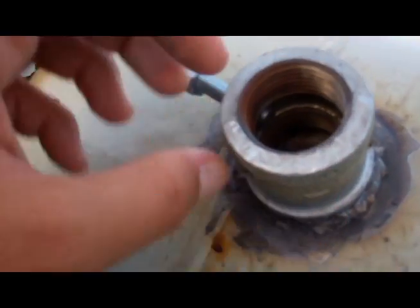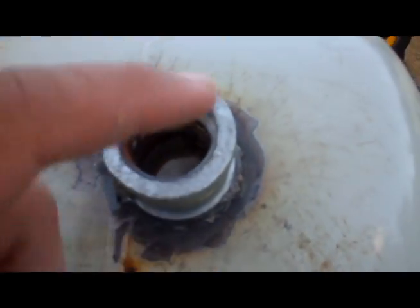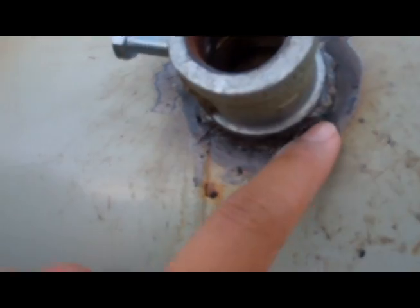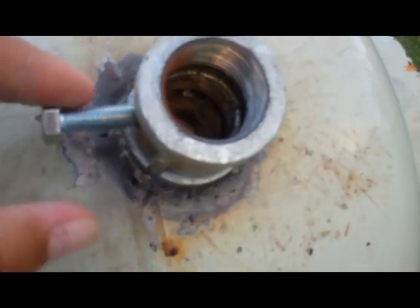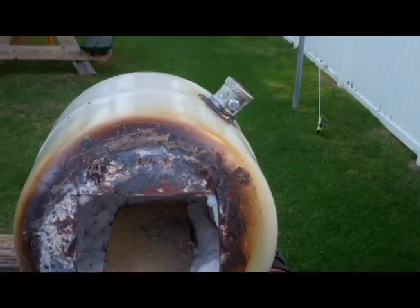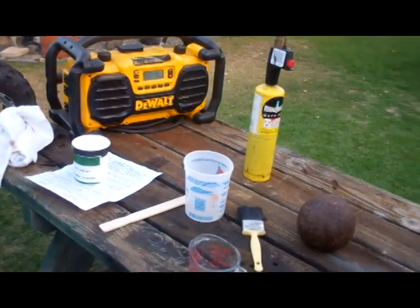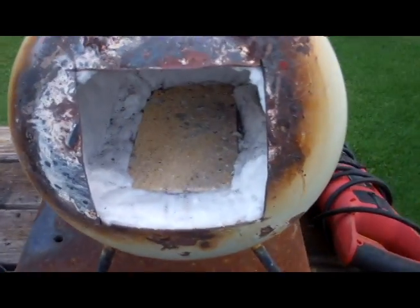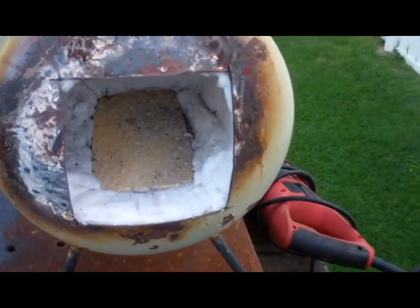And I've got a one inch piece — welded it on, you grind that galvanized garbage off, weld it on, drill and tap a 5/16ths hole in and boom, there she blows. So that's my holder. Let's coat this thing, and then when we're done coating it, we'll move on to the burner, which has to be fixed. Okie doke, be right back, gonna do the vacuuming.